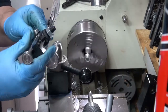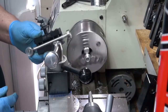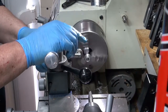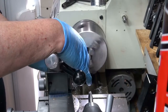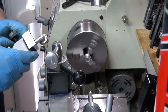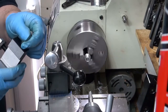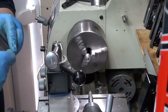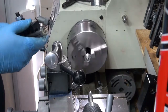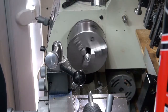When you're making a push tool, put the bearing straight on, and you want it to work both ways - so you want to be able to mount it in the tool post that way and push that way, and then turn it this way and push the face. Don't do what I did. I thought I'd put two bearings on the end of the shaft either side - don't try and be clever like that, because when you turn them around, if one is angled, they both push the same way. So that's another idiot's job I've done on that.